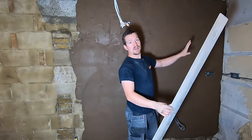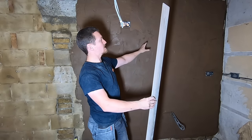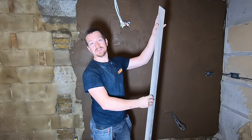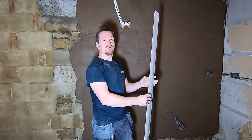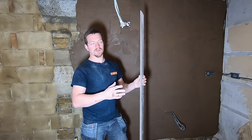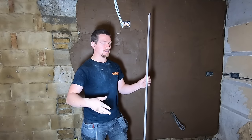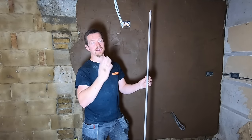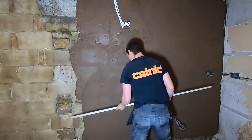I've got a section on — you don't want to go too far ahead of yourself. Now you've got two options: you can leave it and just scratch it, which a lot of people do and there's nothing wrong with that. But with my scratch coat, I just like to give it a little rule — try and get it straight when you can. Because when it comes to the top coat, we're really going to be focusing on getting it perfectly flat and straight.